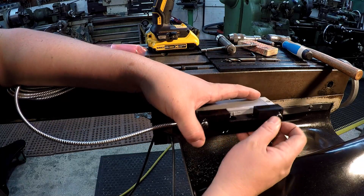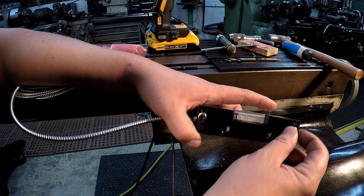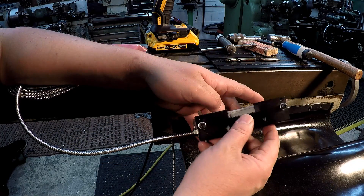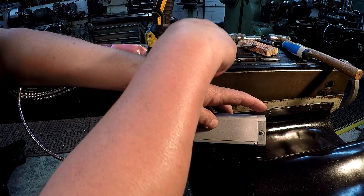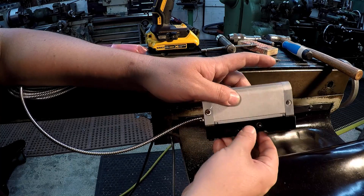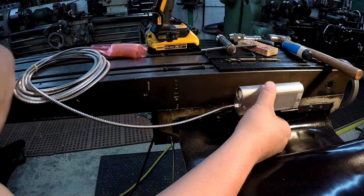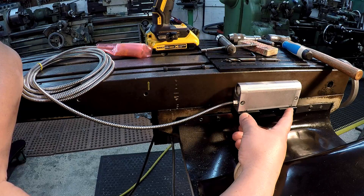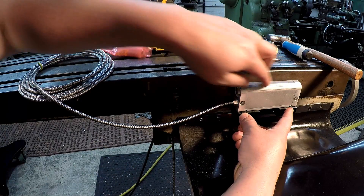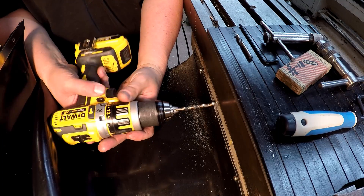So I'm having to redo what I've already started. I'm using this bracket — I've got some bolts in there right now, and I even drilled those holes out a little bit to use a different bolt, so it'll still work and give me a little bit of room for adjustment. We'll use these two holes right here and use the supplied six millimeter bolts to mount that in this location. I need to find a transfer punch, find the center, and get one drilled and tapped. Once I do, I'll level this up really nice, transfer the other hole, and get it drilled and tapped using a five millimeter drill.